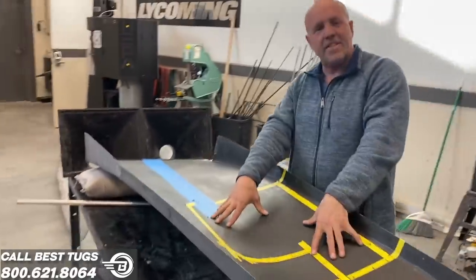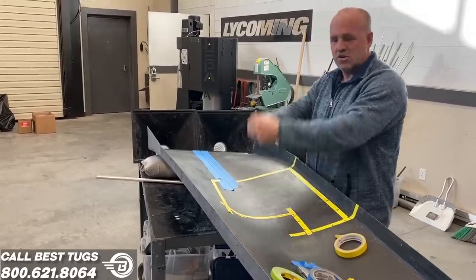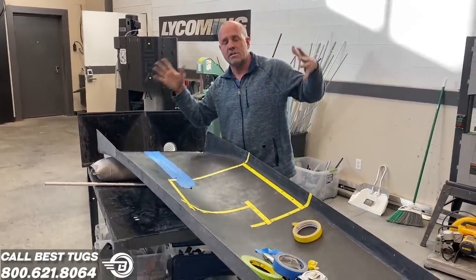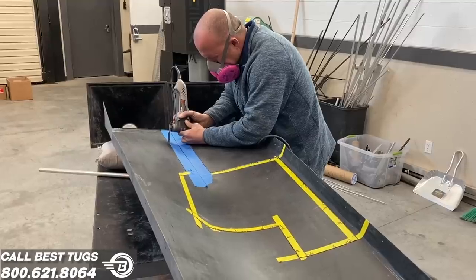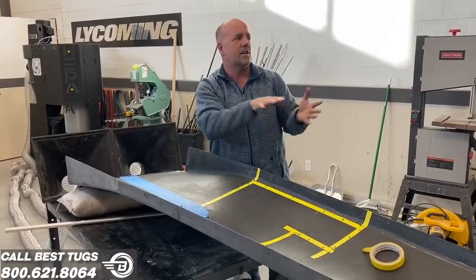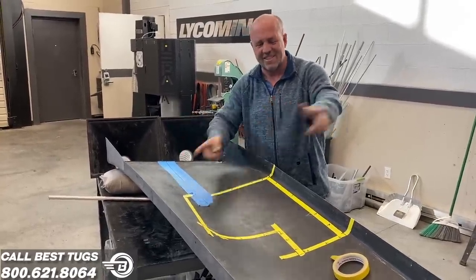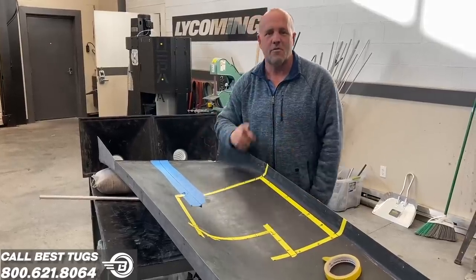Marked out the parachute pad that launches out. This little pad right here is for the rocket deployment — it will pop out, then the rope will drag out the center section and the parachute will pull through here. This will be one of the tracks, goes up to the front of the aircraft, splits off, grabs two forward attach points, and at about this point it grabs the rear center attach points. So it'll be a three-strap parachute on both sides of the CG envelope — the straps are outside that envelope, so I can never come down at any attitude other than what we set the straps for. I hate to cut this thing up — it's really all done — but I've got to cut this out, make an overlapping lip, and make the parts removable.